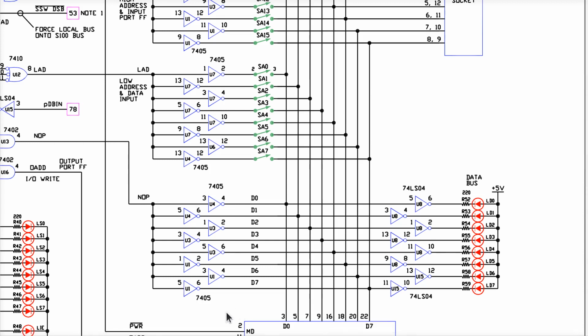The only way that wouldn't happen is if every gate in this set of gates was broken, and this is the only one that's working, and this signal is not what it's supposed to be. That's an awful lot of ifs, okay? Generally, that's not the case. It could be. Like, for example, if every one of these was on U4 and then this one here was on U5, it might be the whole chip is dead. That is a more likely situation, okay?